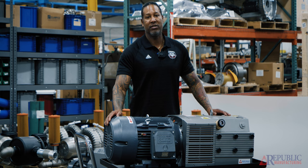The dry vane pumps are primarily used in places where you don't need a very deep vacuum. For instance, in some of the printing industry, some hospital systems, as well as some sparging systems where you need up to maybe 15 psi — you can actually use a rotary vane style vacuum pump.